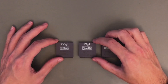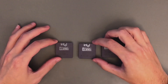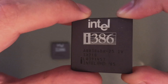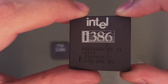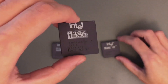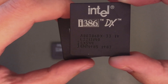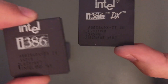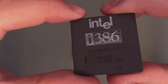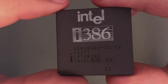This benchmarking was not enough to satisfy me, so I started raising the voltage trying to see the limits of these CPUs. I put the voltage to 5.2V and tested all of them. Interestingly, the 25MHz model was not the slowest one — at this voltage it managed to boot at 50MHz, but was unstable. The newer 33MHz chip — I actually have two of these — one completely failed at 50MHz, and the other was unstable but a little bit better than the 25MHz one. The one that clocked higher was again this double sigma variant.